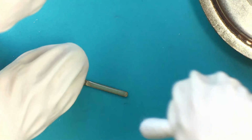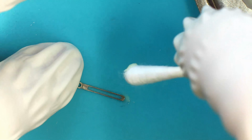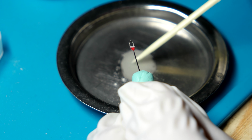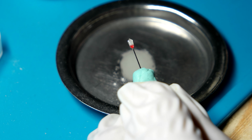And again, just take the hand off, use some IPA on a Q-tip to wipe it off, make sure it's clean, and then just try again. And if you're having trouble and it makes you feel any better, I went through 2 sets of hands on this build and relumed both of them several times just to get it right.